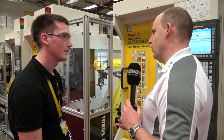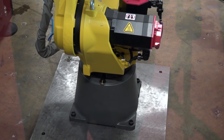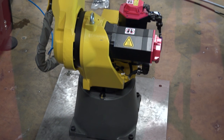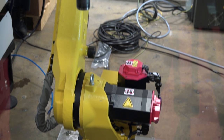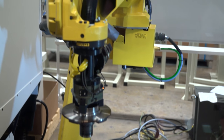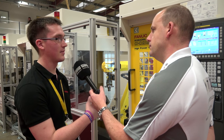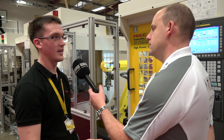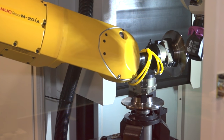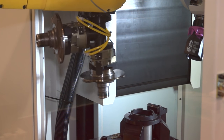How complicated is that to do? It sounds very easy — would you need experience in setting up automation cells prior to this, or is it as simple as: you've purchased it, I'm a subcontract engineer, I can get into it straight away? Yeah, it's very simple. The manual which comes with it has two chapters — one for the drill, one for the robot — and the screenshots basically say go to this page, set parameter X to this value, carry on through that, and then on the robot side it tells you how to get the wizard, which buttons to press, and exactly what you need to set.